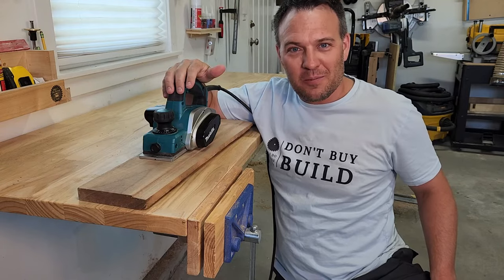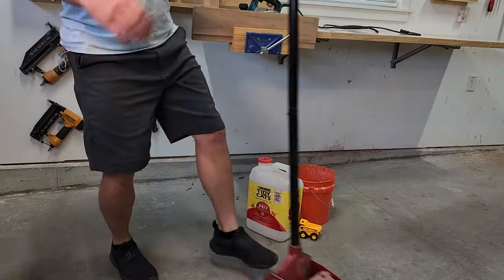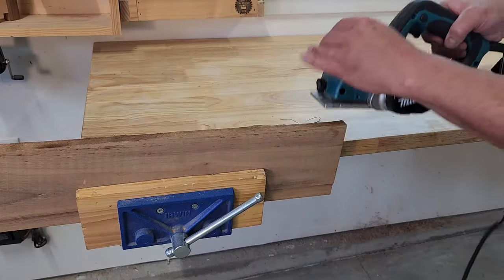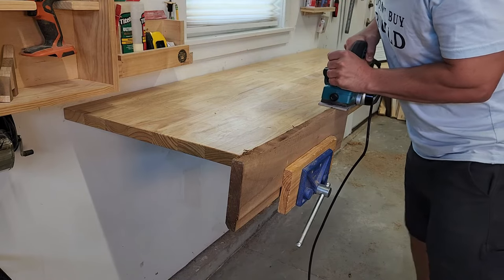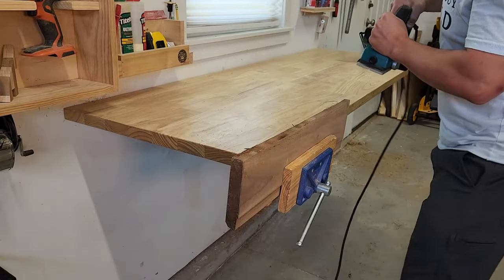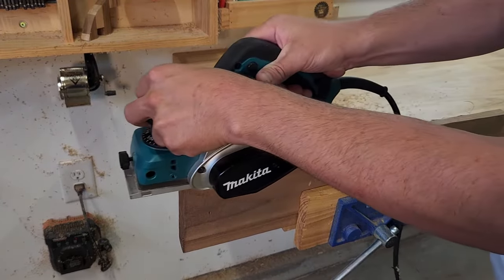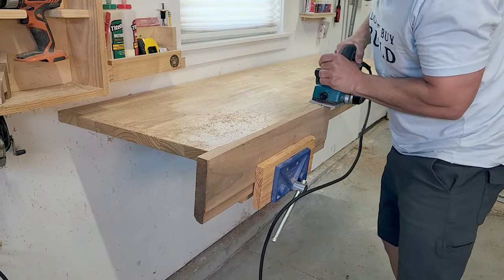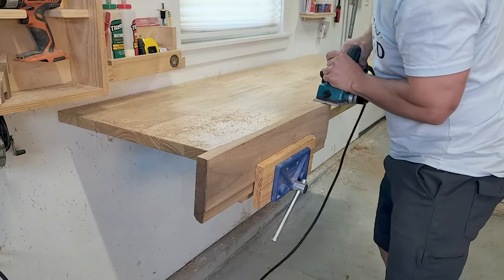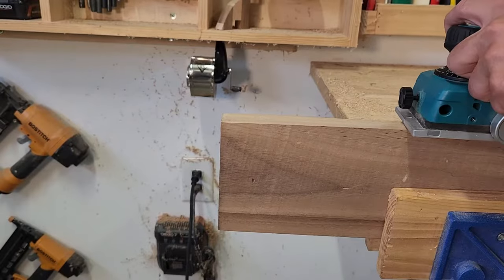Now that our blades are all sharp and adjusted, we're ready to start planing something. First, securely clamp your board down and make sure the area is clear of any loose clothing or long hair. Be sure to carefully inspect your board for any nails or staples — the planer blades do not like metal. Be sure the entire area underneath the board is clear so you won't trip when making your cut. Hold the tool firmly with one hand on the knob and the other on the handle. Start by putting just the front shoe on the workpiece without the blades touching. Keep more pressure on the front of the planer when starting your cut. Then bring the motor to full speed and gently move the planer along the workpiece at a steady pace, using balanced pressure in the middle. At the end of the workpiece, put pressure on the back to prevent the nose from diving down, and as soon as the blades are through the wood, bring the planer up off the workpiece. You can take quite a bit of material off in a single pass, but for smoother cuts it's best to take small passes and remove a little wood at a time. If you don't use this method, it's very easy to snipe the workpiece at the start or end of your cut.